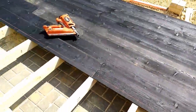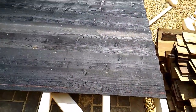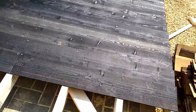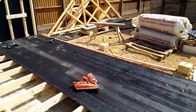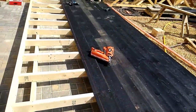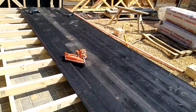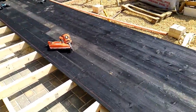It isn't an accident that I've done it at that point — by the time this is on the wall it'll be about five and a half feet up. It's no accident I've done it there because these are the courses most likely to catch your eye if you're looking at it. So once this panel is stood up, this course here will be about five foot up, so it really does want to be straight because that's the one that's likely to catch your eye. If it's a bit up and down, you're going to see it. So just another little tip there.